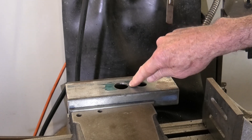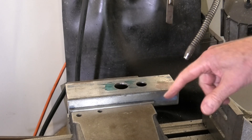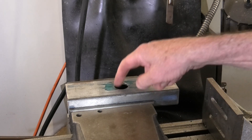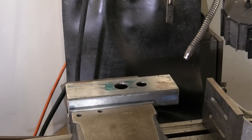You can see I've already slotted a couple of wheels. The slotting tool's going into the side there. You can also make up different size pins if you've got different wheels to go in - as long as the spacing's the same. I could drill another crank pin hole on the other side for a different wheel. This is setting it up for the wheels I'm making for my Sweet William.